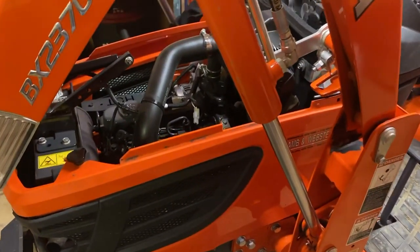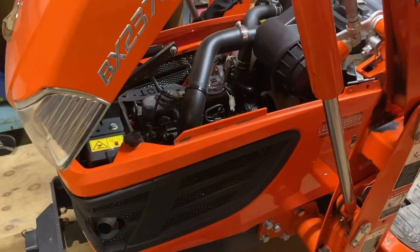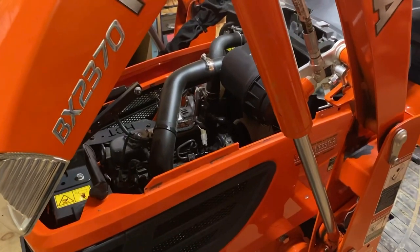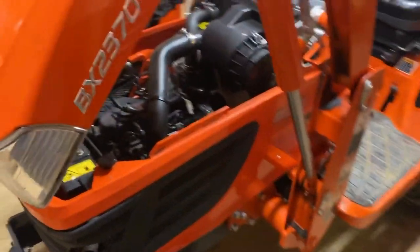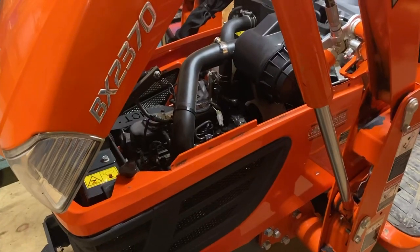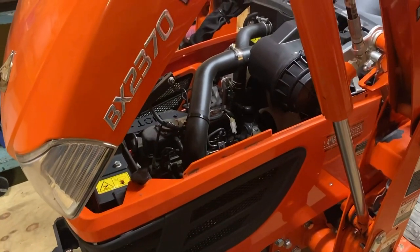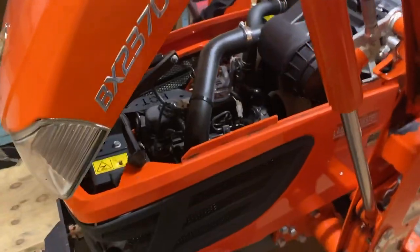Okay guys, so I'm back in the shed today working on the BX. Last winter I had my block heater go out during the polar vortex. If you look on my channel you'll see the cold start video. I think the day after that video is when my block heater quit. It was working for that video because the block was warm, even though it was like negative 40 wind chill. I think it just shorted out — something happened inside with the coil that heats up. Basically it's just a lot of resistance happening, which creates heat, and that heat warms your coolant which in turn warms your motor and helps it start easier.